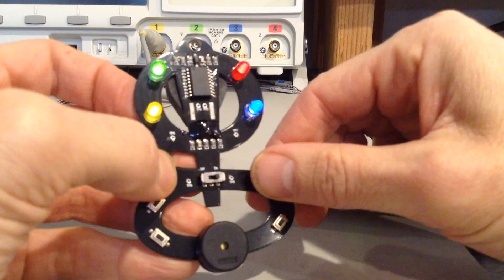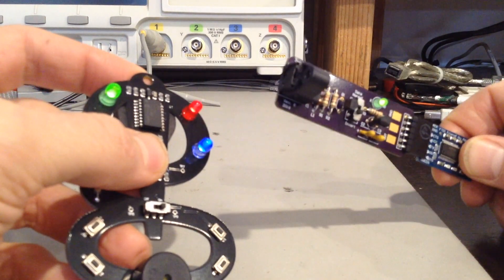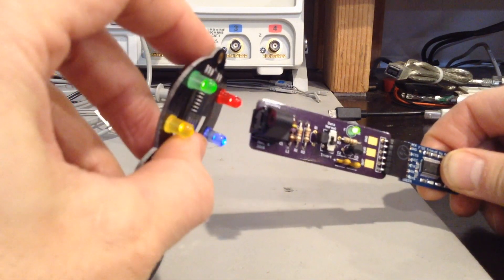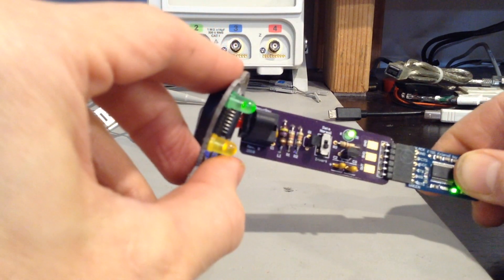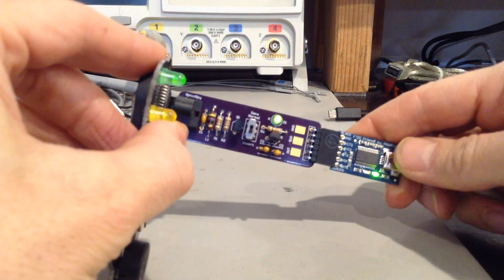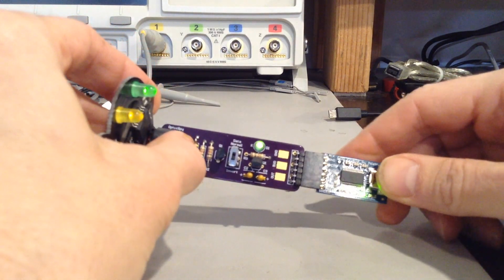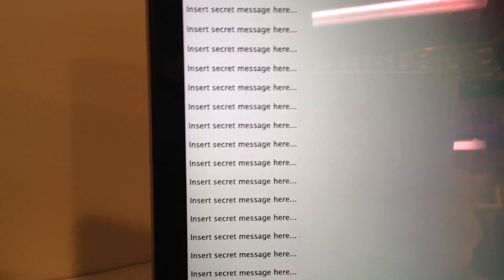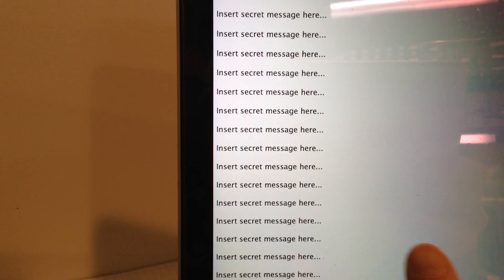Right now all the LEDs are on, but the red LED is actually transmitting a secret message. So if everything goes well, I should be able to just put my receiver module over that LED and see on a terminal program what data is being sent. Put that in there — normally the optical cable goes in there, but we'll just shove the LED in instead. We can see the green light on the FTDI Friend turning on, which means it's receiving data. So let's hold this here and take a look at the terminal program: 'Insert secret message here.' That data is being transmitted over a UART interface through the LED to the receiver module and displayed on the terminal program.